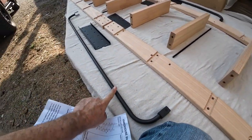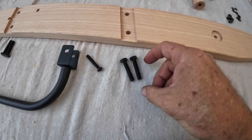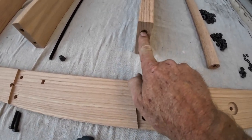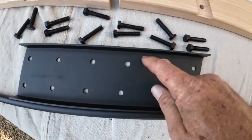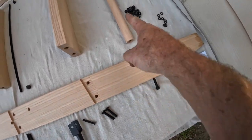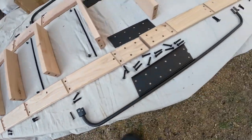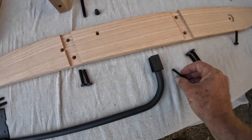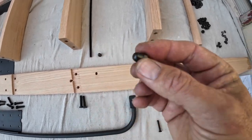In my case there are 50 big bolts for this 108-inch ladder — this probably varies for different heights. Some will use nuts and some won't: where they go in and thread through here there are captured nuts, so those don't need separate nuts. But where the bigger bolts go through the frame you'll use a nut on the back side. There are only four smaller Phillips-head bolts for holding the cross rail in, and some capped nuts so you don't scratch yourself.